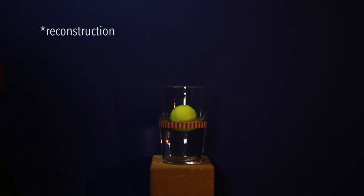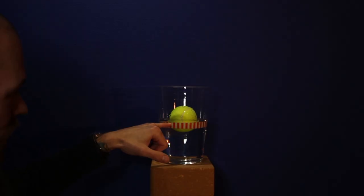The displacement hull is the go-to sailboat hull — it's the classic. Here's my definition: a displacement hull is a boat hull design that uses buoyancy to support itself, not dynamic forces like lift, but buoyancy. It needs to be very round and bulky, is partially submerged, lies inside the water, and pushes water aside when moving.